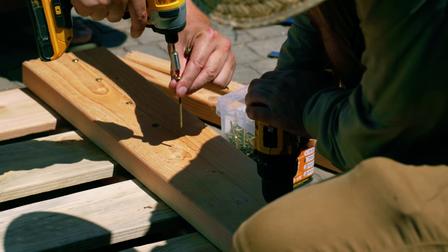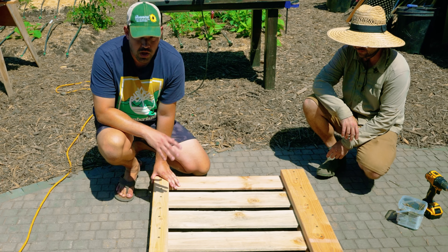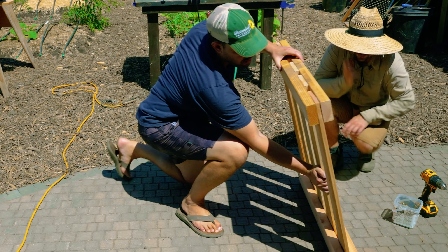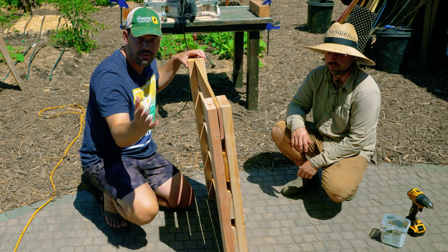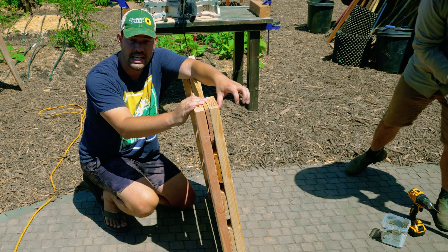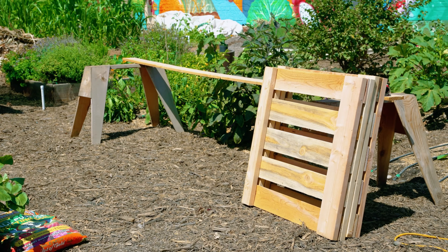One side is in. We're going to put the two by six on the other side — same idea, just a sandwich. Our first panel is built. This is going to be the back of the bin and it'll roll up to the front. After we build five more of these panels, we'll put on the apparatus to slide in the front slats and another post to keep this from moving once we finally set it.